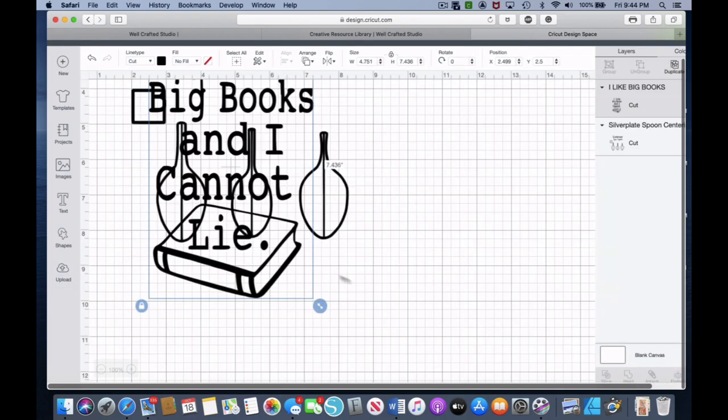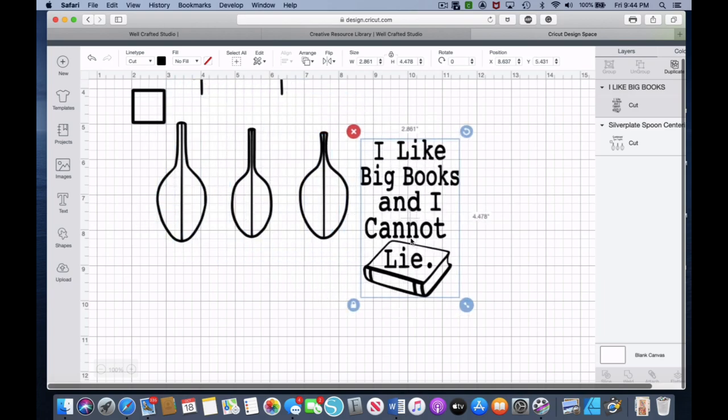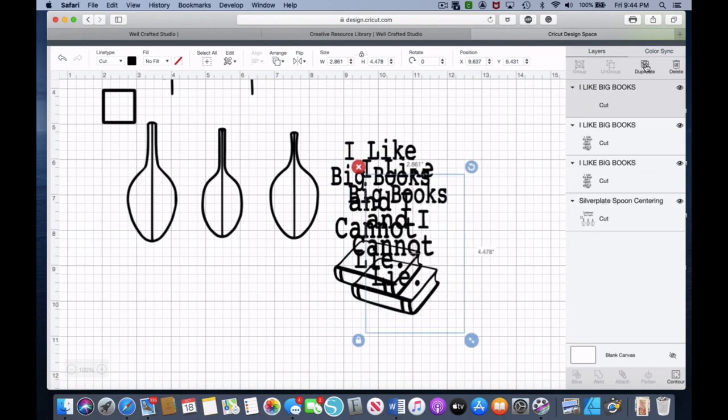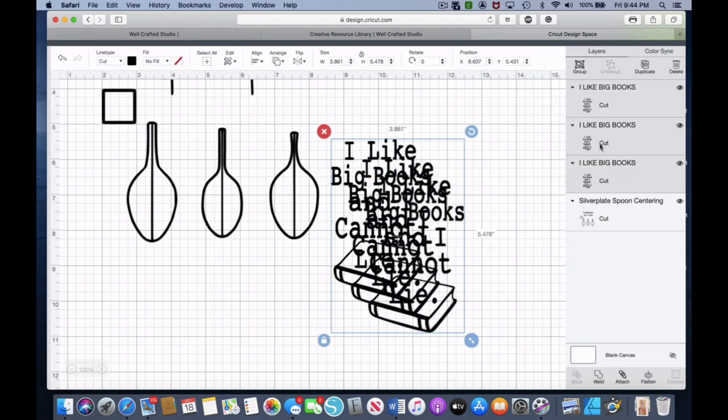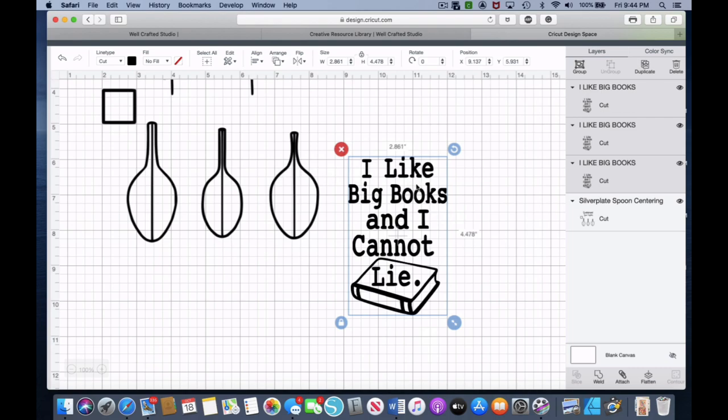There it is — Insert Image, and we've got that. We're going to drag it down a little bit smaller, then come up here to Duplicate. So this is selected, and we go to Duplicate a couple of times so now we have three of these. I'm going to select them all and go up to Align, and choose Center. What this does is give us three different cuts all in the same spot, so when we engrave it's going to engrave over this three times instead of just once, giving it a deeper cut which will help the engraving show more.